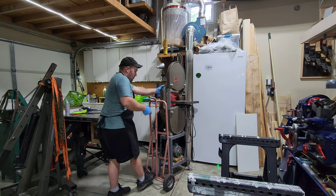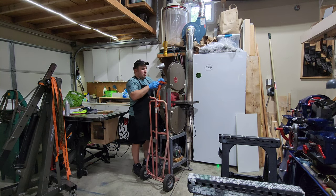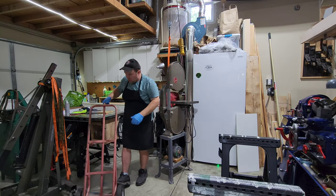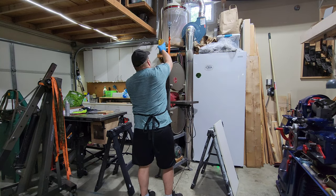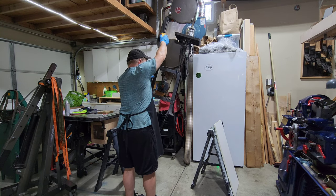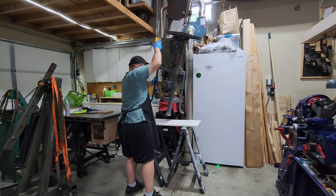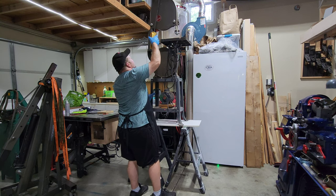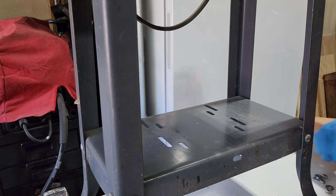When it comes to working on machines, I have an electric overhead hoist, which I find to be very beneficial and a back saver. Disclaimer: anytime you're lifting loads overhead, make sure the equipment is rated for it, and never stand underneath the load — never have any part of your body, fingers, toes, anything underneath that load in case it falls. Always plan on things failing and you'll be okay in life. I'm adding a board on top of two sawhorses and lowering the saw back down on it, but I'm keeping tension on the hoist cable so if one of those legs falls off the table, it will be safe and won't tip over on me.